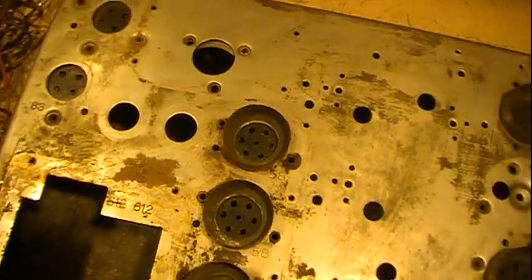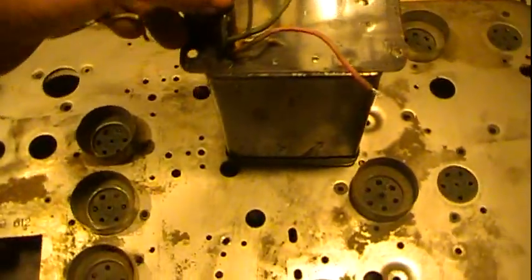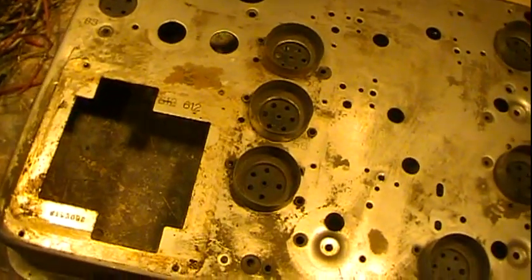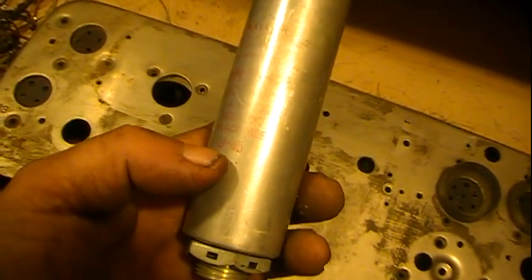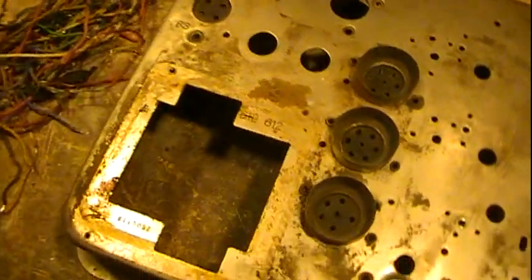The interstage audio transformer is good too, but it's not quite as bad where they go inside — other than a couple of them, there's still some insulation I can work with, so it may be alright. Power transformer is good. It's had one filter cap replaced; I've already opened it up, and it was made 9 of 45 — meaning September 1945 — so this was replaced probably sometime in '45 or '46.